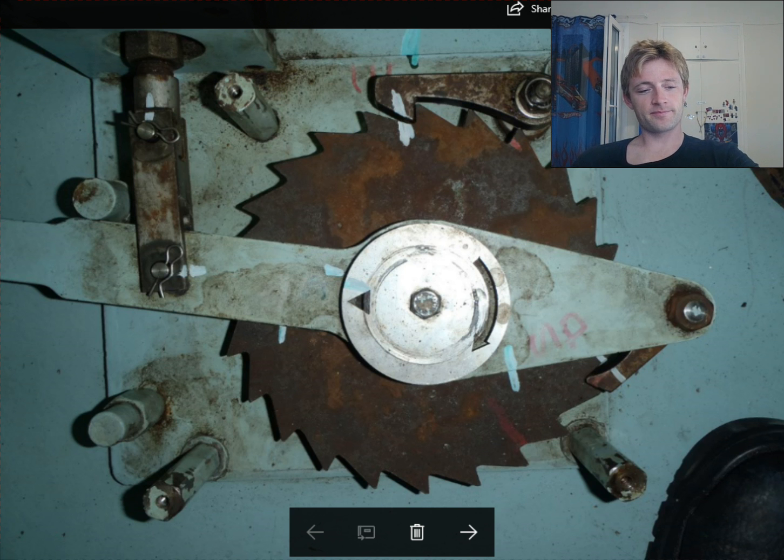As you can see, there is a mechanism here with metal brackets and some pinions, which are marked with a pen to see the exact positions of each part. Just remember to switch off the power panel of the filters, shut off the air — there are some small air controllers for the blow. Isolate the filter, close the inlet and outlet. If your pump is stopped, or you can keep your pump running and just bypass this filter.